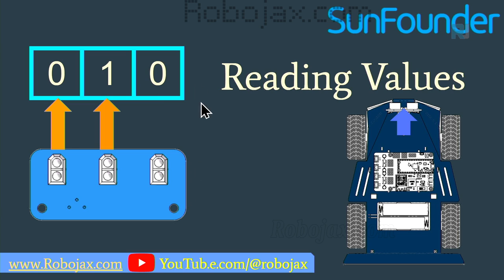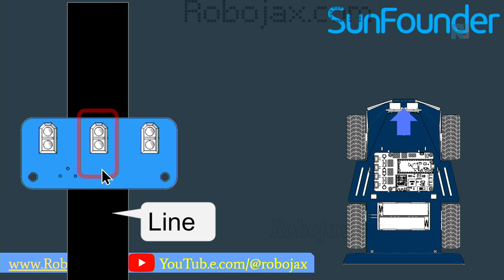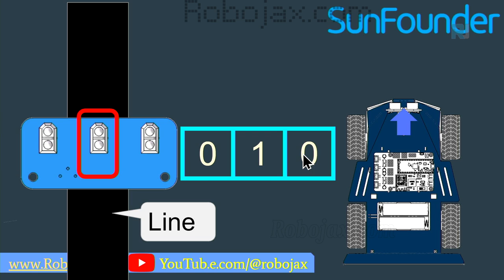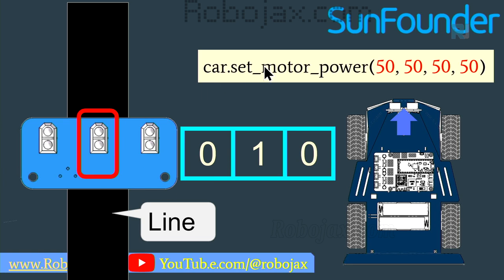We will have values like 0 or 1, depending on whether they are on the line or not. In this case, the center sensor is on the line, and the value that we read is 0, 1, 0, because this is 0, the middle one is 1, it's on the line, and then 0. Because the car is on the line, we use this function: if the wheels are rotating at 50% power, all four will be 50, 50, 50, and the car will proceed forward, and it doesn't need to go left or right.